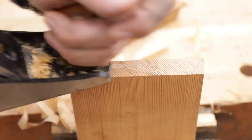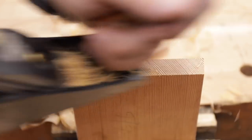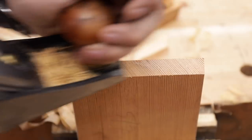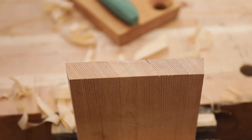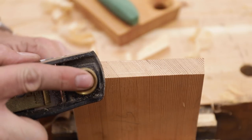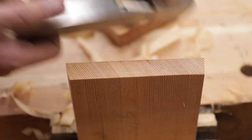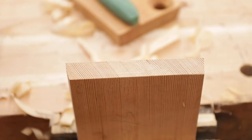When coming back, I'm lifting the plane — I don't want to drag it back and lay those fibers over. I have to say the block plane actually works better — it's a little more coarse, you can feel it. They don't really match up so I'll just use the one I have to make sure they look the same. With the iron set really shallow you can knock those sharp edges off — come from both sides at 45 degrees and take a little curly shaving off there, just enough to avoid slivers.